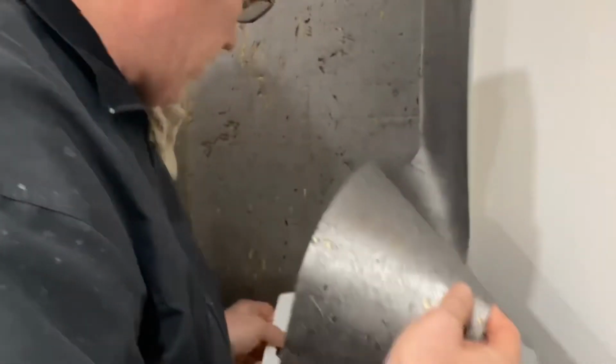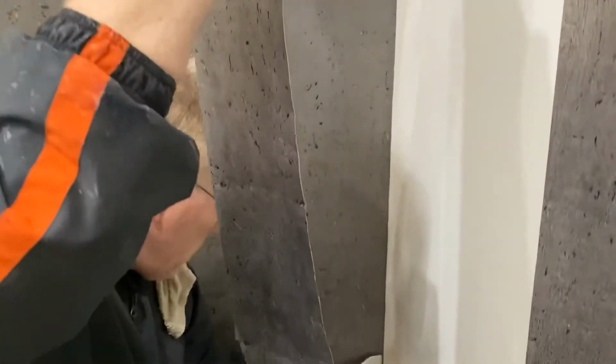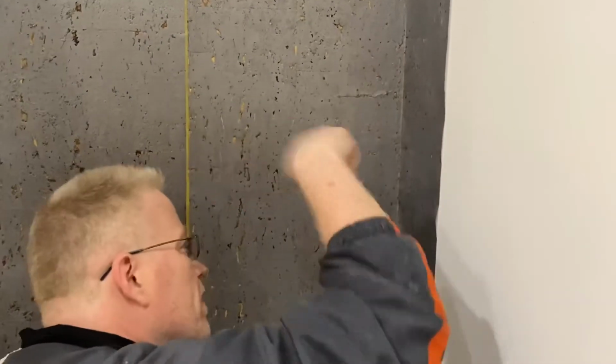I can demonstrate it down here for the good folks at home. You see this edge? You see it? If I were to overlap this edge on top of this, you'd see it. Please bring them in close so that they can see this action. This is a lot of work. Because it's off plumb, you must keep moving it back and forth to accommodate the crooked corner. These are buckles caused by lack of plumb.